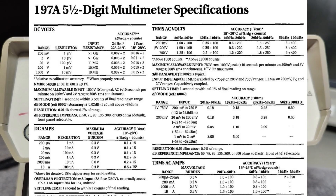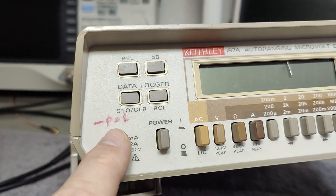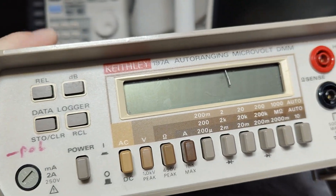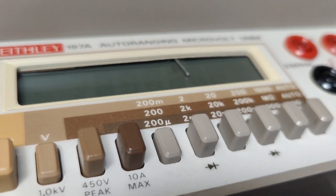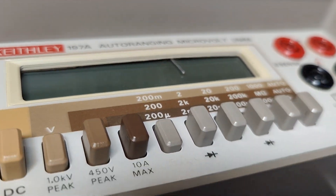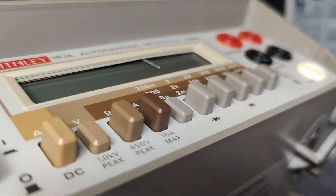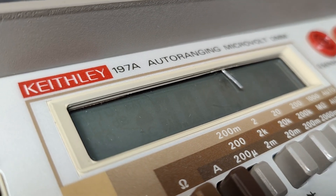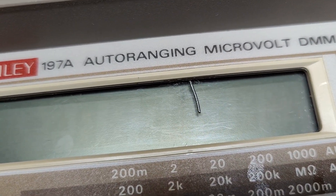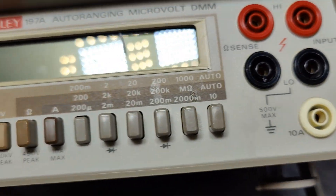That is quite amazing, so I think we will find a very good voltage reference inside this unit. I really hate it when people write on front panels — please don't do that. Since this is an LCD meter, there is a classic problem with LCD panels and the interconnects down to the circuit board behind it. This is how they tried to fix it by pressing in a little piece of metal, causing all sorts of funny things. So I hope I can fix this. This also creates some scratches.